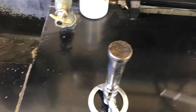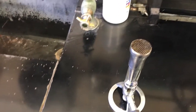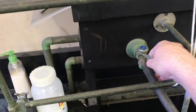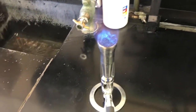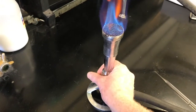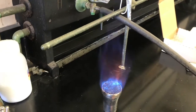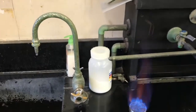We'll use not a Bunsen burner but Bunsen's big brother, the Fisher burner - it gets the glass very hot and then we pull and stretch it. Turn on the gas line so it's in line with the tube, then use the striker to light it. We want a very hot flame - the hottest part is where you see the little blue jagged flame. You can adjust the airflow by twisting it, but you need that jagged flame.